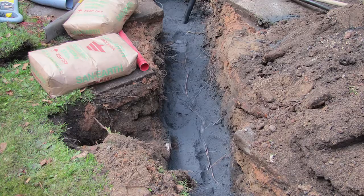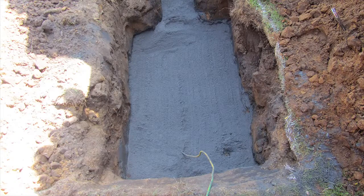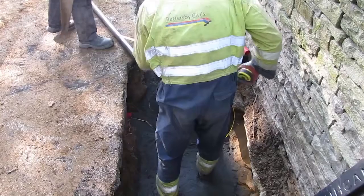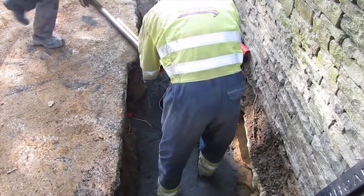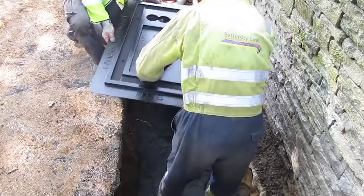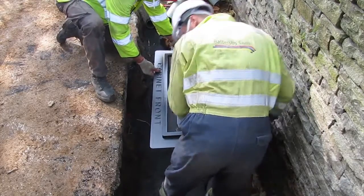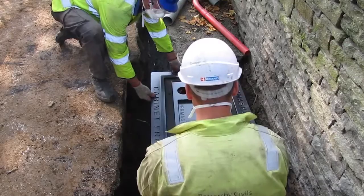For the long-term performance and longevity of the electrode system, it is imperative that the copper electrode does not touch the earth and that it is fully encapsulated in the powder. Allow the insulated earth cable to protrude up through the conductive concrete in the desired location. Use the D-slam plinth template or polylid to determine the exact location of the insulated copper electrode. This is typically the back left-hand corner or the specific location marked on the plan drawing.